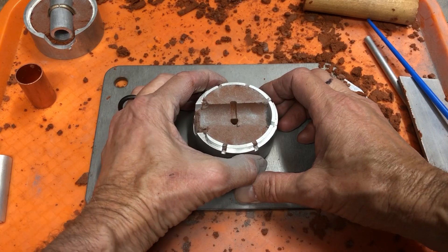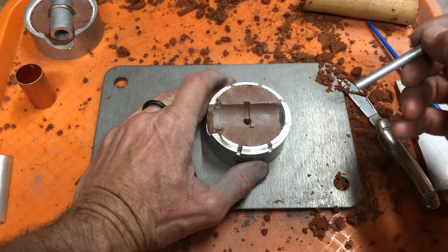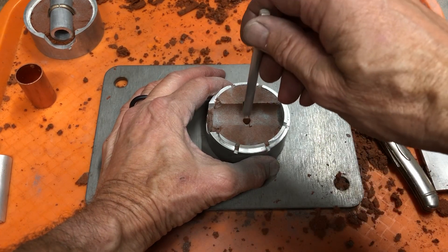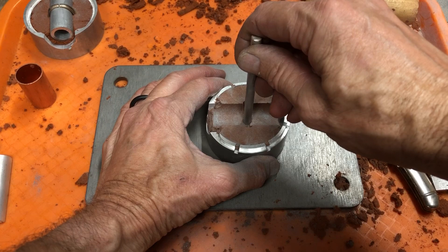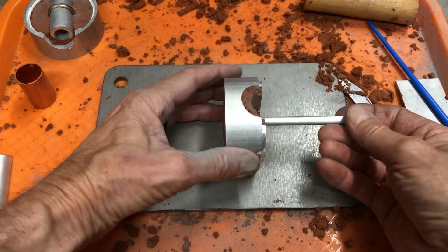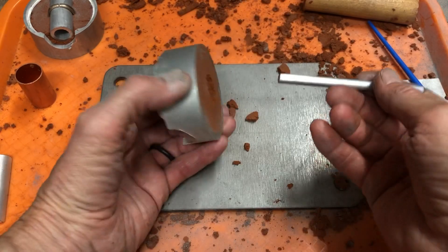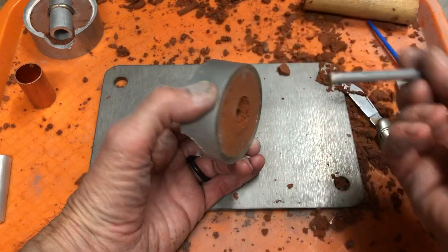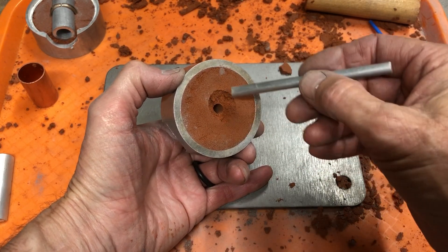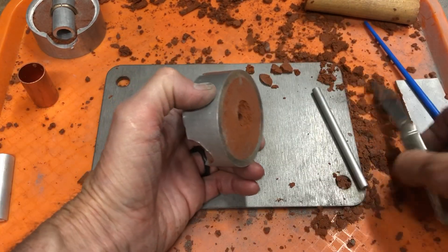It's better to do it on the side and pull it back out like that. I found that a heavier or larger main sprue helps a great deal with this type of casting. So I have a larger piece of aluminum here — I'll put that right there in the center, push it down, turn it on its side and push it through. What you don't ever want to do is push from this side going that way, because it will peel up some of the clay and it'll be a mess on this side.